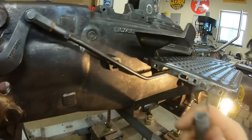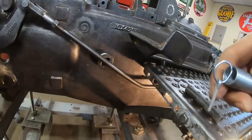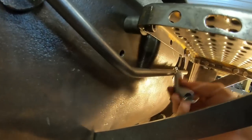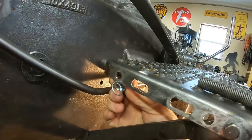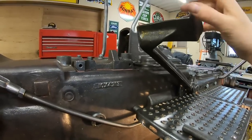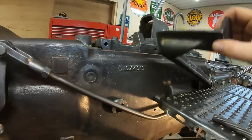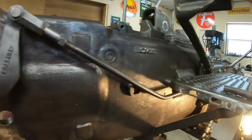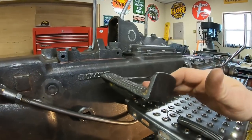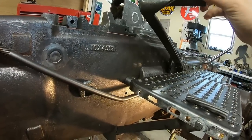Let's try something a little bit heavier. I found this spring at my hardware store — it's a little bit larger diameter coil. The hooked ends aren't exactly the same, but we can place it in and see if it has a good spring rate to help that pedal. We've got some more tension on it, it's up a little bit higher. Yeah, that would be a great help — taking a lot of load off that bearing. But unless you hooked your toe behind it and pulled it back, it's not going to have returnability, and I want it to return on its own.